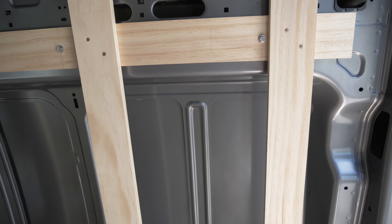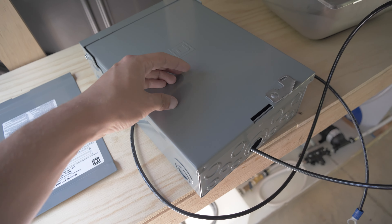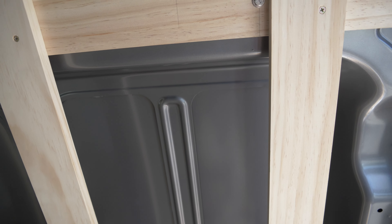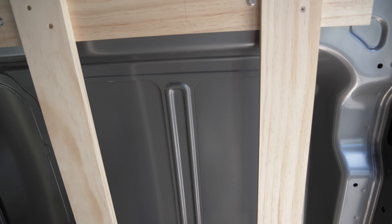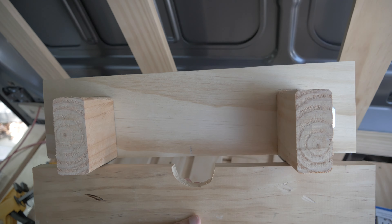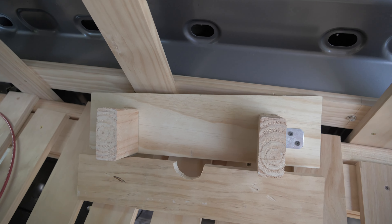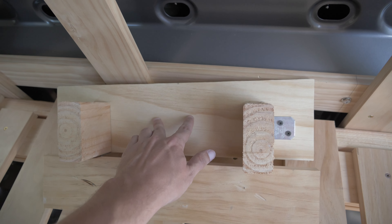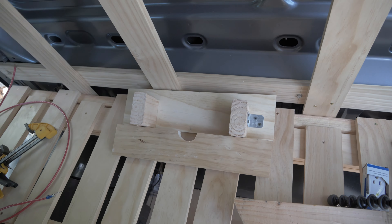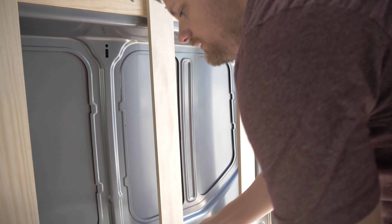I'm thinking of putting the box right here. There isn't a really convenient way to attach it — there are holes I can put screws into but I can't screw into the frame directly. So what I did is create this custom bracket. I'm thinking I'll screw this into these planks and then the breaker box will sit right here — I can screw the back of it into this and it will rest on this board. I'll put the bracket up and screw it in the way I want, then put in the breaker box.